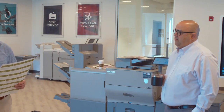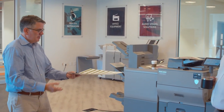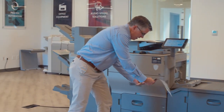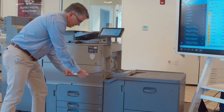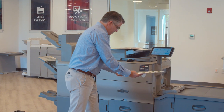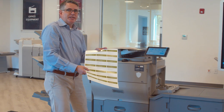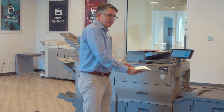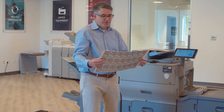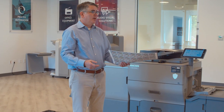We use what they call a rotary gate to stop the paper. When the paper feeds from the large capacity tray, it'll feed in and get a lead edge, then a side edge — that's how an offset press feeds. It'll register this side, register this side, then pull it through and start printing. For the second side, it prints and self-corrects. It's a very cool feature, and very important to anybody who sells print for a living.